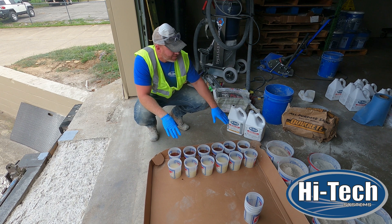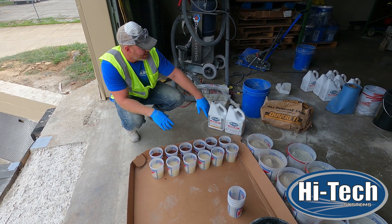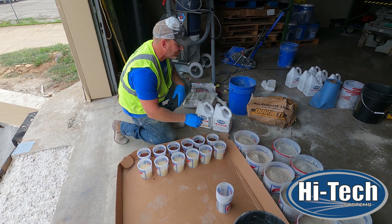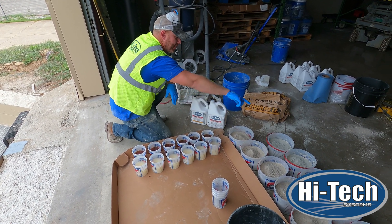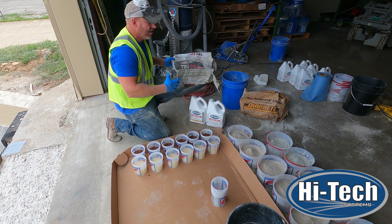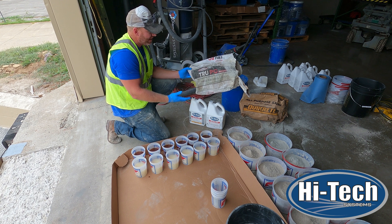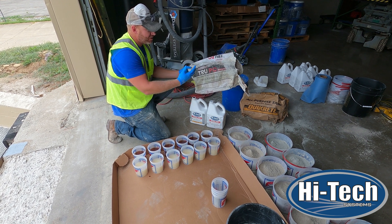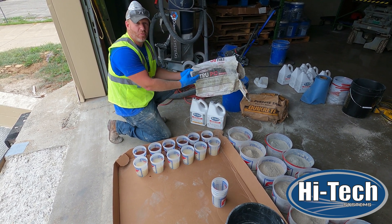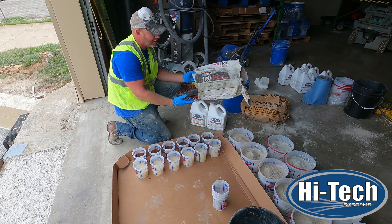With that 40 ounces of TX3, we've got a couple different mixes here. We've used some Portland cement mixed with Quikrete all-purpose sand in the front row, and on the back row we've got some TruPC natural — you can also use TruPC gray. The great thing about mixing TruPC with the Hitech TX3 or any Hitech urethane product is it already has the aggregate mixed in, giving you a really nice salt-and-pepper look, or a slightly larger aggregate if you're using it in a polished application.